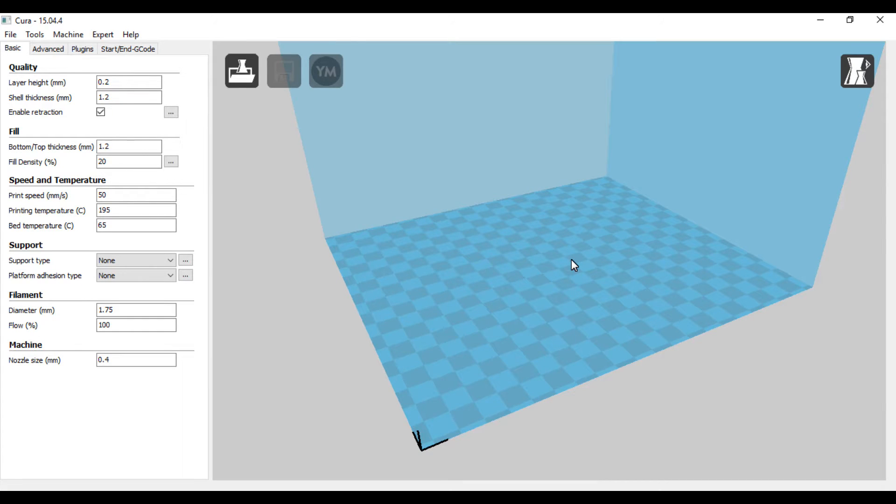Today I'm going to print a model — it's a rocket that's going to be hollow. Joel over on 3D Printing Nerd has used it several times. I want to give it a shot on my GTech and see if it can handle it. It's the first time I've ever set up a print with no infill — it's going to be a spiralized model, so instead of going around several times making a thicker layer, it's going to be one single pass all the way through until it's completely finished.